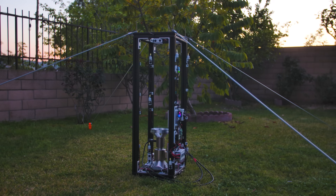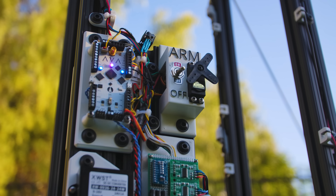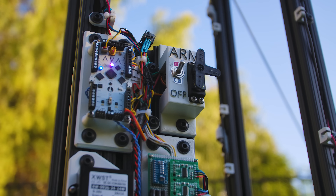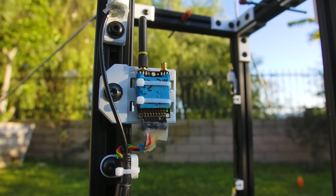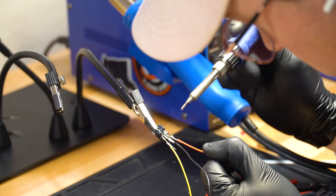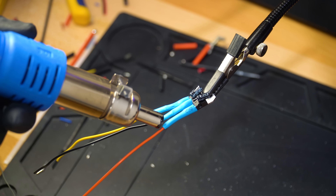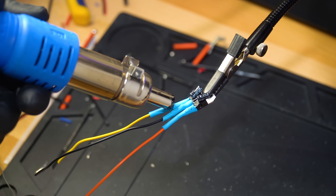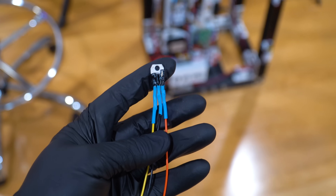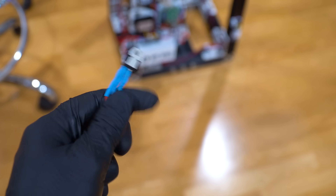I'm really pleased with this remote arming system and it gives me a lot more confidence when it's time to hook up the ignition leads for the motor. We ended up breaking out a separate 5-volt supply line on a linear regulator to the telemetry radio. The RFD-900 is pretty sensitive to voltage spikes, and the voltage booster was really messing with Ava's buck converter, which would occasionally send a voltage spike into the radio — which tells me that Ava's power management structure needs a little bit of work.